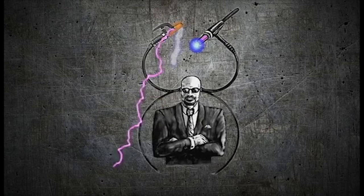This is the finished product. I ground it down on each side, flat side. Sometimes you've got a little bit of room to play with — if you see a mild imperfection, you can be careful, but take the tiger paw along the whole length of that strap. As you can see, I rounded the corners. You want that whole strap to be rounded all the way around — those corners rounded from top to bottom. You don't have to worry too much about the root or the cap. You might have a little bump at the top where the cap was.